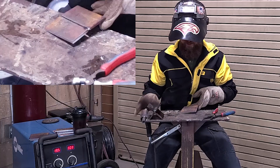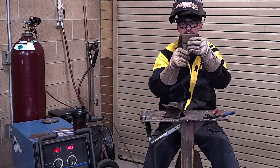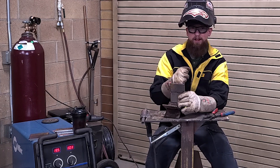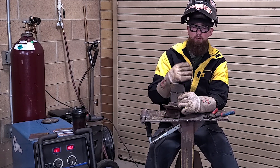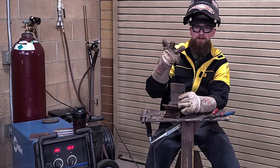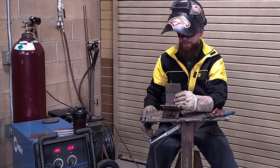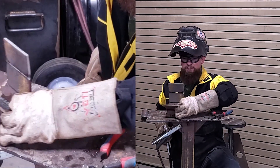We want to make sure that the gap is even and flush all the way down. We're going to tack the other side. In each booth there's a positioner that you can swing around and tack this to so it's more right in front of you — I recommend that because it's going to be a little bit easier. I'm going to scoot my stool back and kneel down to get a good vantage point. You want to make sure that you as the welder can see the puddle and are comfortable. The ABCs of welding: always be comfortable. While we're practicing and learning, try and get comfortable. I'm going to tack this butt joint right here on the edge of our multi-T.